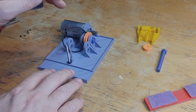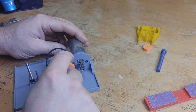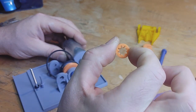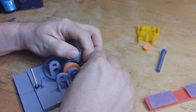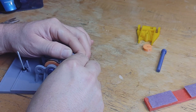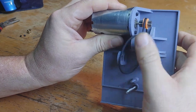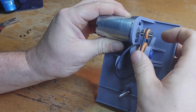Next, we engage the motor to the reduction pulley. This motor has a pinion pressed onto the shaft. My original design had this driven directly via a gear, but it was getting too hot from too much friction, so I changed it over to a pulley by making this adapter that goes over the pinion and turns it into a pulley instead of a gear. Then the smaller O-ring — I think it's a 1-3/4 by 5/16 inch O-ring — slips on there. This can slide back and forth but won't fall off, as this part here keeps it aligned. The motor is now hooked up to the reduction pulley.